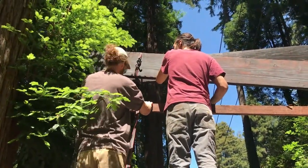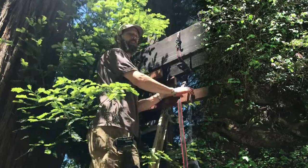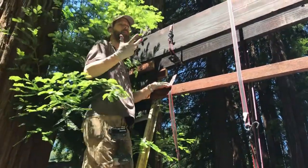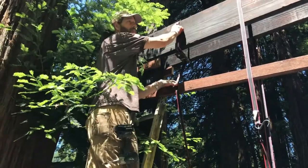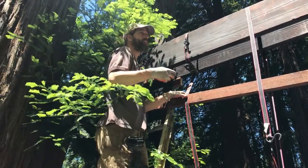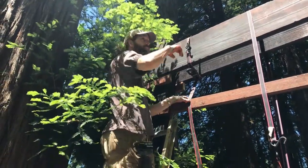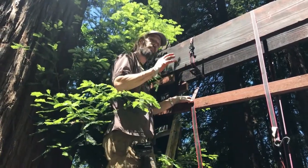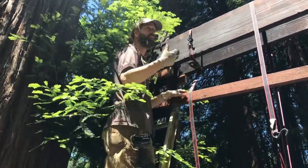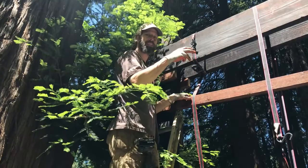Earlier we were trying to lift this with just two ladders. The trigger point that made me want to stop — I think we all have a little internal voice that knows what's safe and what's not. It's just hard when you realize it's going to take a lot longer with more safety steps in place to actually stop, back off, and rethink the whole thing. But once we came up with the ratcheting strap idea it felt safe. So: if it feels unsafe, it probably is — stop, rethink it, make it safe, and start over.